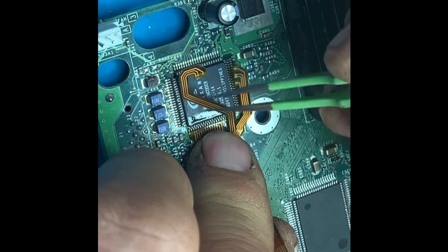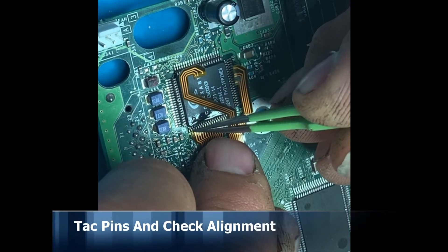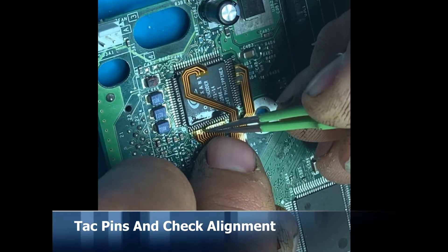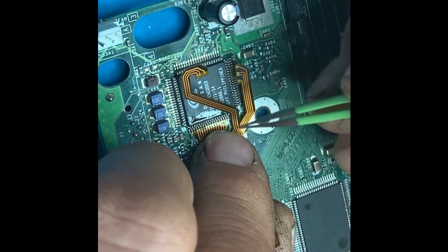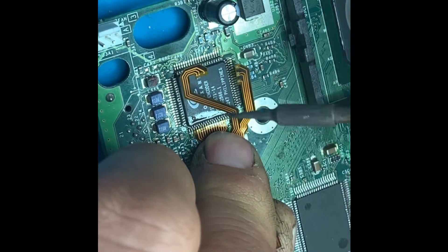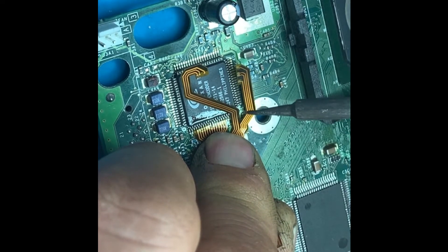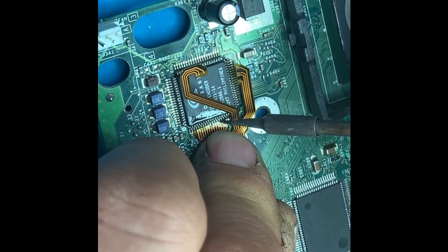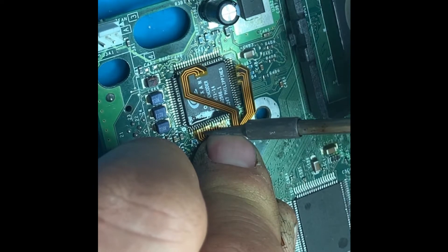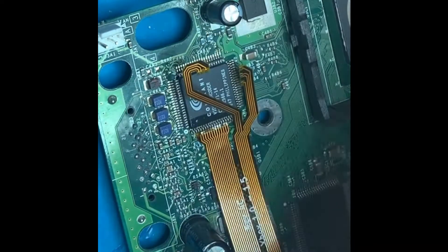When installing this, you need to refer to the online documentation — it's best to have that in the background so you can quickly check the pin layout. They provide nice, detailed pictures on their website. I used that to help me determine exactly how many pins in from the edge the flex cable started. Tack it in place, double-check, and then go from there.